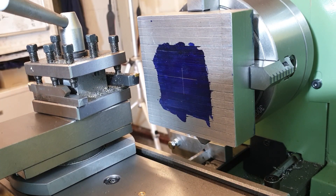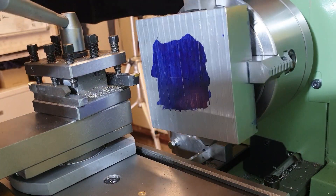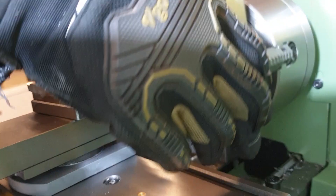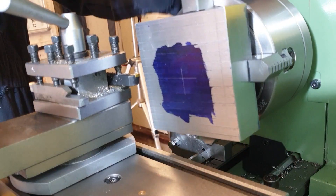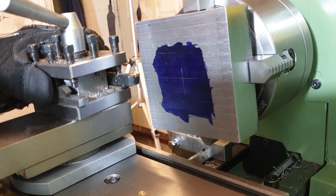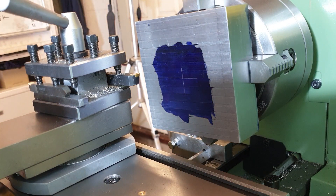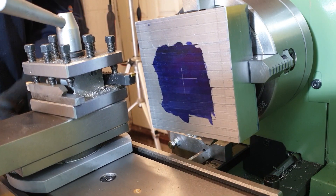The root piece or base top plate is securely fixed into the four-jaw chuck — just make sure they're all nice and tight. I'll need to run this at quite a low speed given the diameter and make sure everything is nice and secure and lock the carriage. So let's run this up nice and slow.